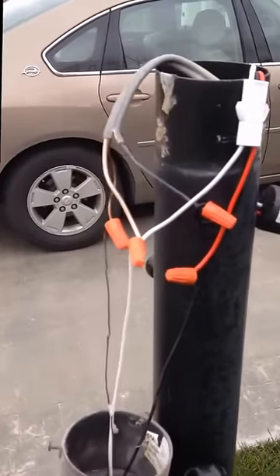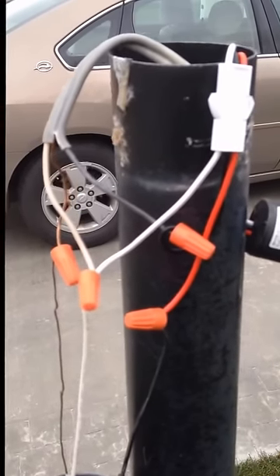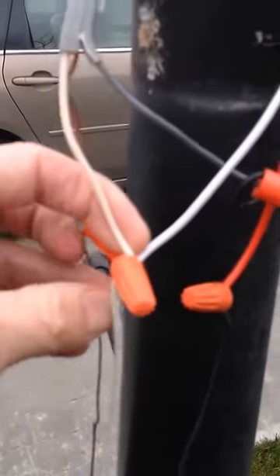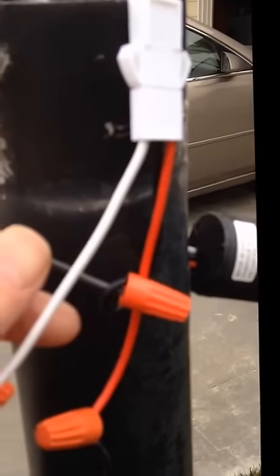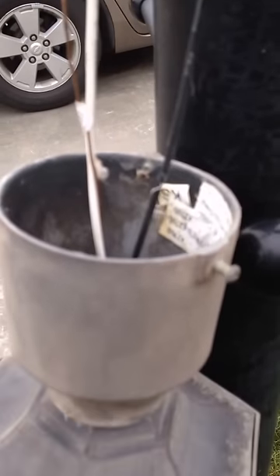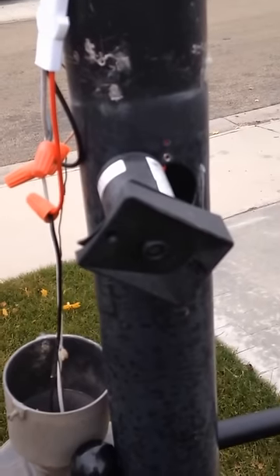I just connected all the wiring. You might want to consult with an electrician - I actually called my brother-in-law who is an electrician just to double check and make sure I had everything wired up correctly. Incoming power goes through the switch and down into the light, and here is the return going back through the switch, and then there is the hot going to the light. Now I just need to turn on the power and cover up the switch for about five minutes and see if the lights come on.